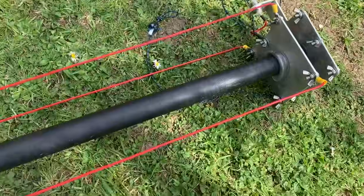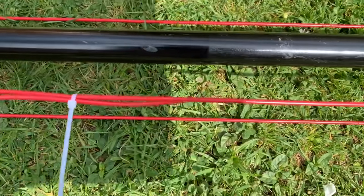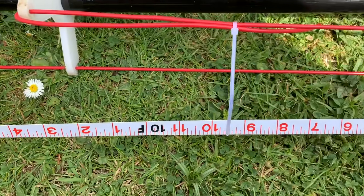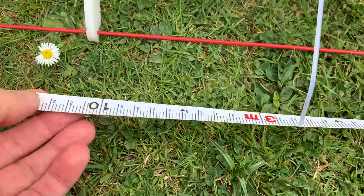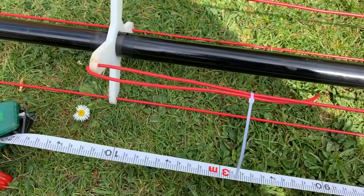What I've done is I took the 10 meter element off and put a 15 meter element on, and that's worked relatively well. The lower one here is the 15 meter band element. It's 10 feet, 3 inches, and goes back by 6 inches — so that's 3 meters 12, and then your fold-back goes back 20 centimeters.